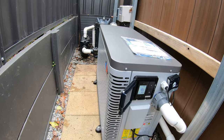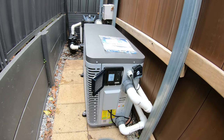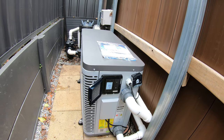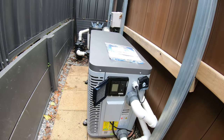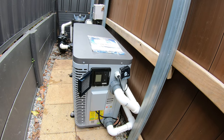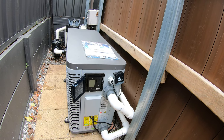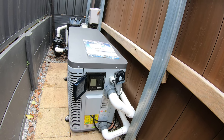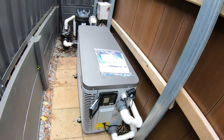Having the J-box installed also allows the heater to respond to climatic conditions. If the heater only needs to run for two hours a day because it's warm and the cover is on, it will switch off the water pump once the pool reaches temperature. But if it's a really cold day with lots of people swimming and the cover was left off, the heater can automatically respond and run as long as necessary to keep the pool at the right temperature.